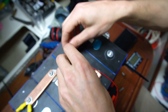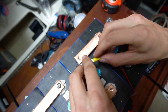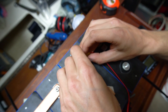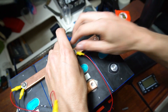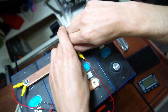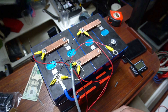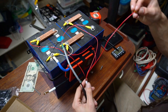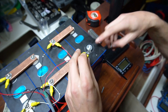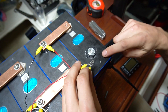You don't necessarily need this other sensing wire — it's just so I can keep an eye on the voltages and know if the cells are going out of balance. You don't want the cells to go too far out of balance. Normally you do what's called top balancing, but the BMS also does some balancing. When you first get the batteries, you're meant to balance them so they're all at the same voltage. Now for the final cell, which is also going to be the main positive.